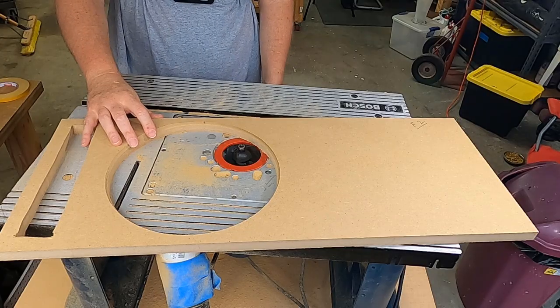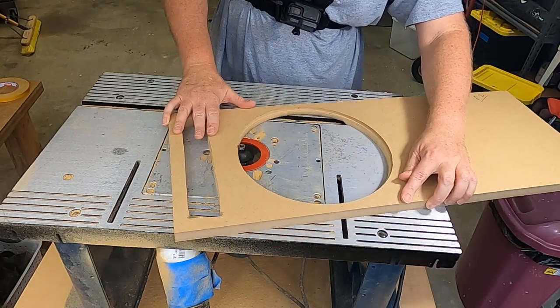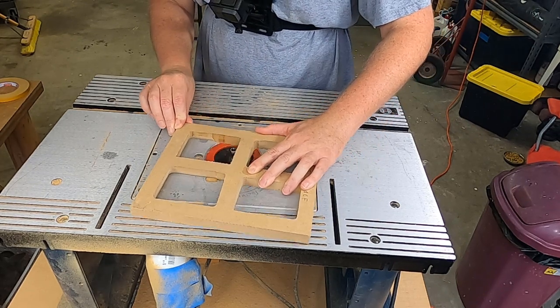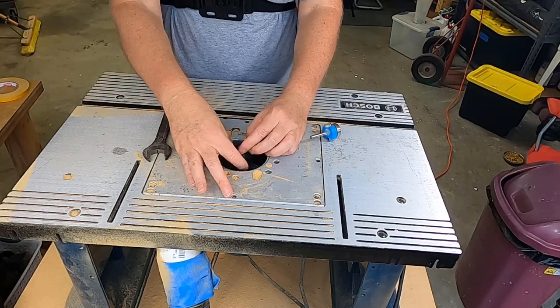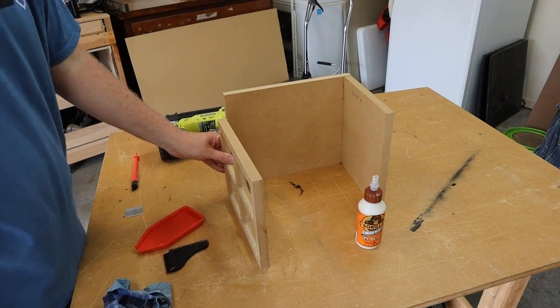As I get better and review my footage, I start to see little tricks that save time. I realized I put a round-over on all my braces, set them aside, then started on the baffle — and lo and behold I needed a round-over on the baffle too. What I should have done was rabbet the baffle first, then when the braces were flush-trimmed, do the round-overs on both the baffle and the braces at the same time. That would save a couple of router bit changeouts, which can actually save a lot of time.